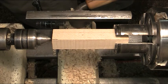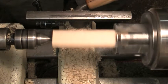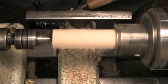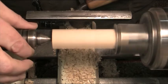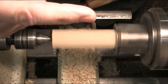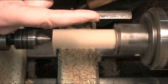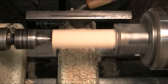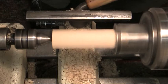I'm not going to do all the sanding on camera. Now, just before we start - this tailstock is here just for support. I can stop the piece with just a finger touch. All I want is a bit of support; I don't want to push the point in, because when I make it really thin it'll bend the bar. So I want to keep the bar straight. I'll just make it a bit tighter to take that squeal out. First thing we'll do is round this thing off.